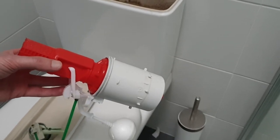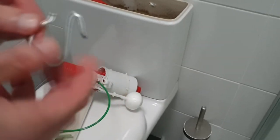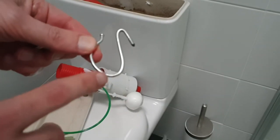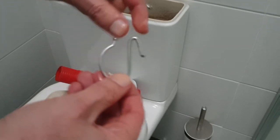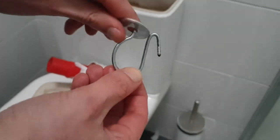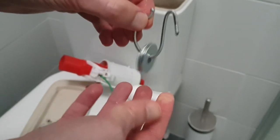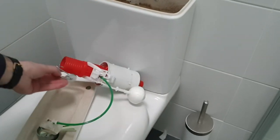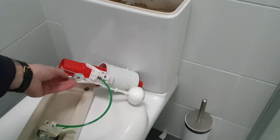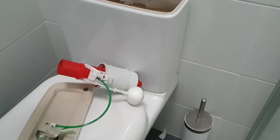What we're going to do is take a bit of wire — in this case, a bit from a coat hanger twisted to make a hook — and we've got a section where we can stick metal washers. The more washers you put on, the more weight it adds. We hook that over the top here and that pulls the whole center section down, providing the weight to stop the water from flowing back into the toilet.